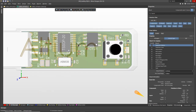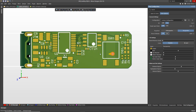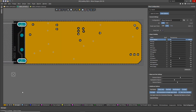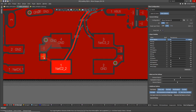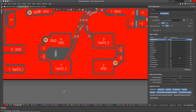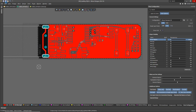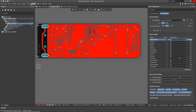As a quick eyeball check I'll go to 3D mode. What I like to do is turn off all the 3D models and just look at the board like it's a completed board with the silkscreen, because that's a really good way of seeing instantly when you've got silkscreen objects over solder mask openings. There's that final net — I'll re-pour all the polygons. That board is complete, and it's only been about 35 minutes start to finish. Of course we still want to generate some manufacturing outputs.